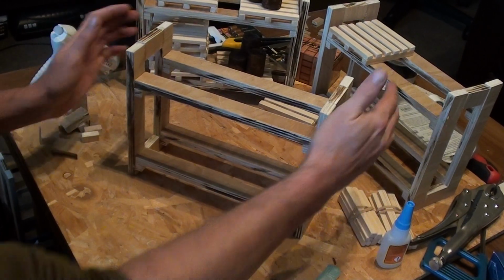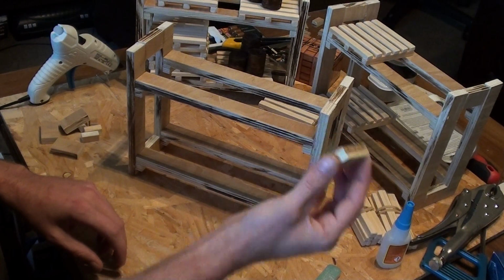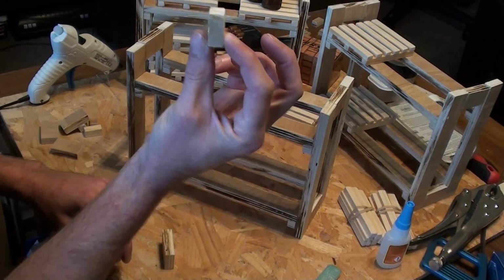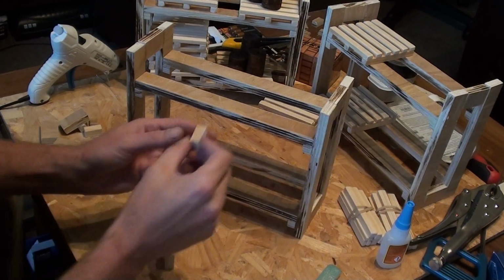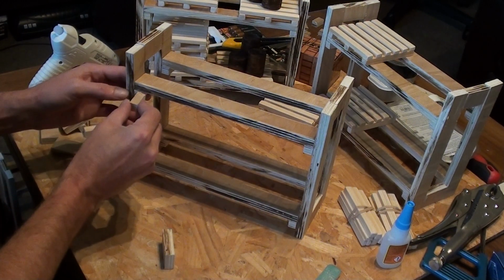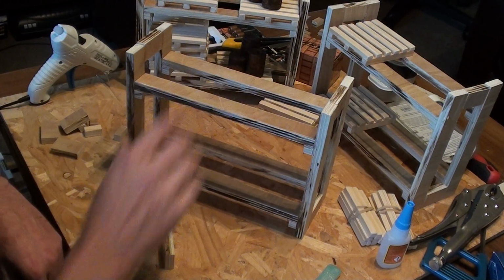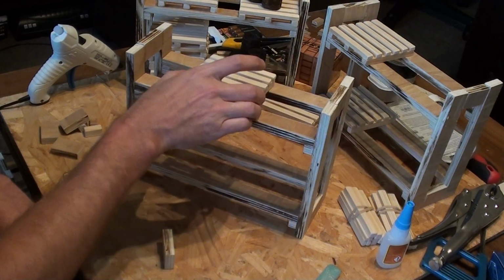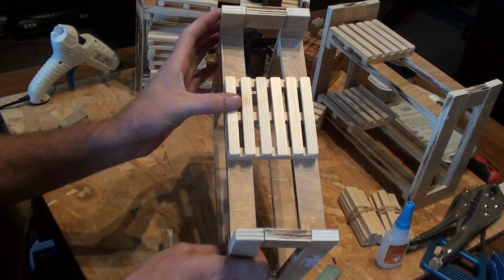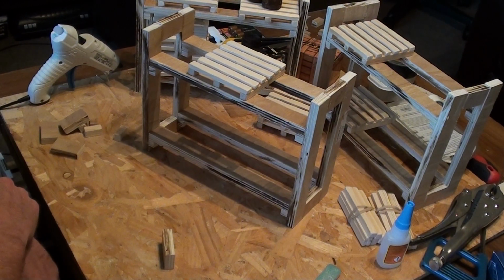along with the four racks and the four sides, you obviously need four spacers as well, and they were the 2.5 inch roughly spacers there. And also some little resting blocks. You'll need eight of these. I've made them about a centimetre squared. You could do a 1/2 inch block or something like that. And eight of those, two for each rack piece to sit on. So the way I designed this was for a full pallet to sit basically flush with the rack itself. So there you go, you can see there's not really much space each side of that, and that fits on quite nicely.